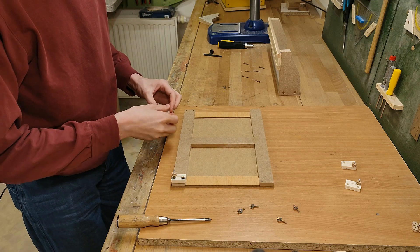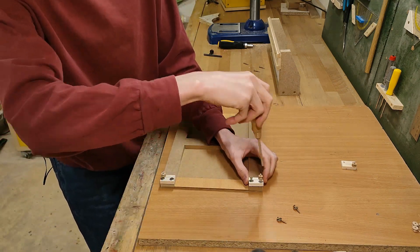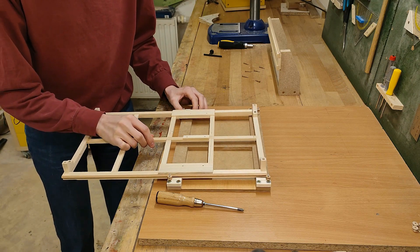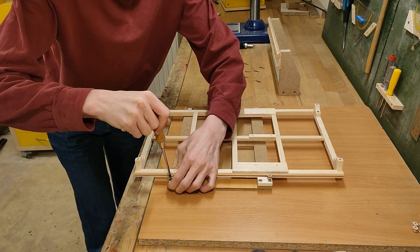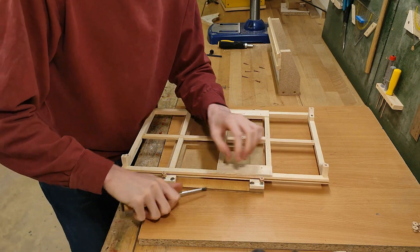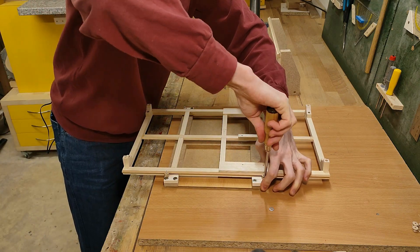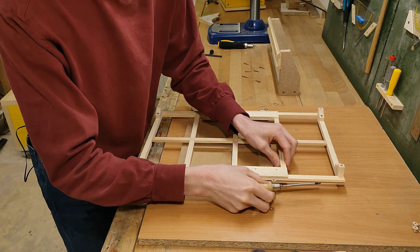I'm not going to tighten them down totally so they can move a little bit. And afterwards, when I put in the y-axis, I'm going to tighten them down. With these still adjustable on all four sides, I can now put the y-axis in again, then slightly push them against the y-axis in order for the little cutout to fulfill its purpose. I'm just realizing I can't put on these washers because they interfere with the rollers. I need to take them out again. Now the screw is going to go into the wood, which is not exactly what I need. Make them squeeze the y-axis a little bit, then tighten it down. This is rolling very nicely — maybe I squeezed it a little bit too hard. It doesn't really need to be tight, just needs to be tight enough so there's no backlash.